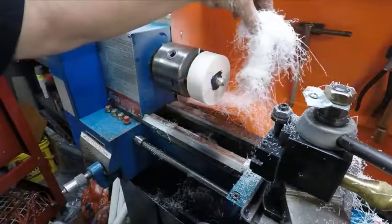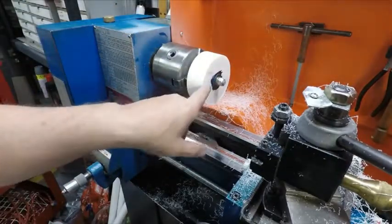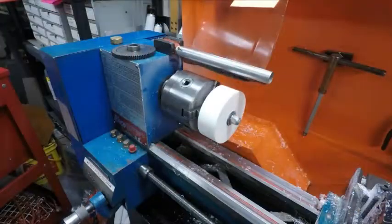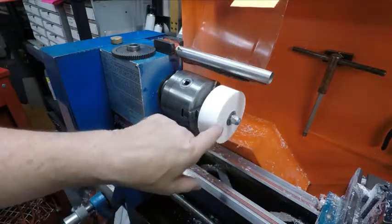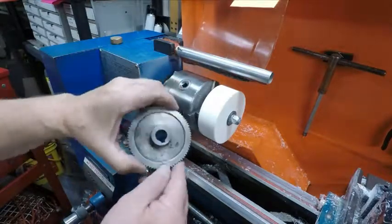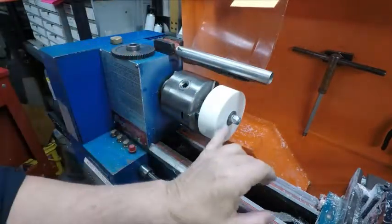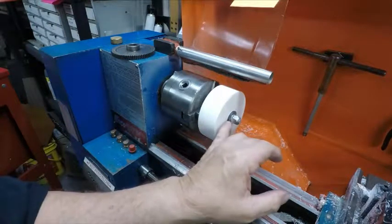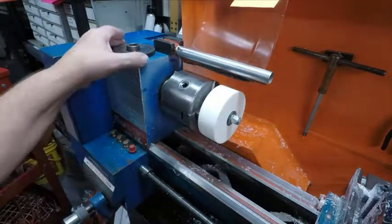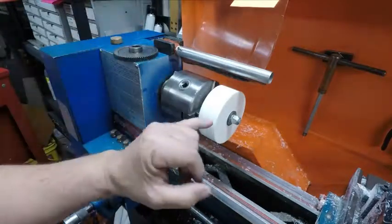Look, I peeled that — is that neat? That cut right off good. So let me get this cut and this faced off, and then we'll see what it looks like. I think I'll face it off next, then cut this down and get it to my size. I faced this off down to this washer I have right here, and with this faced and this faced, it looks like a grinding wheel. But it's really nice plastic — beautiful. I was forgetting I've got to put this hub on here, so I'll lay it out and cut it down that far. This is one inch, and it just happened that when I put my washer on there and then there's a lock washer and then a nut, the lock washer is exactly one inch. I could leave it a little bit bigger, but I'll go down probably close to an inch and straighten it out.